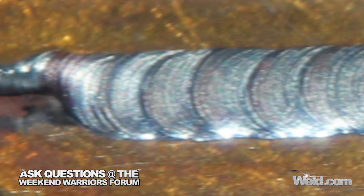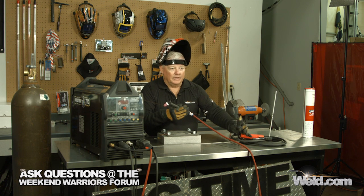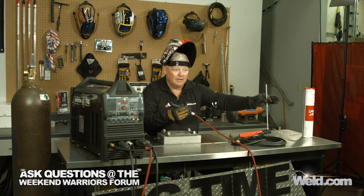That's really all you have to be concerned about when you've got a DC machine. Let's recap: if you're on DC minus, you're going to TIG weld steel, stainless steel, Inconel, titanium — almost all materials except aluminum and magnesium. If you're on DC plus, you're there for a very specific reason: either balling up your tungsten for AC aluminum welding on a rectifier machine, or putting in a stinger and doing stick welding. Remember, make sure your stick electrode is designed for DC plus.